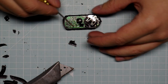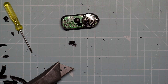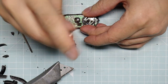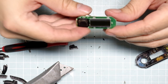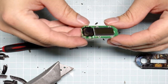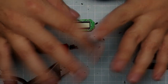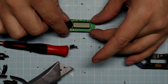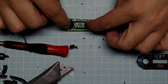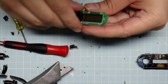Somehow I expected this — it's just a little chip on board and some passive circuitry around. But let's investigate further. Let's unscrew those small tiny screws. What a sweet little display, that is neat. And it's one of those zebra strips, so I would not recommend taking it apart this far, because if this is somehow misaligned you will never make it display anything again — you can see it's already happening because there's missing pressure. Better reinstall that quite quickly.